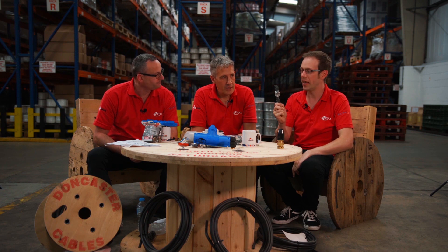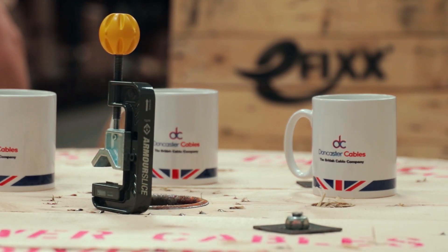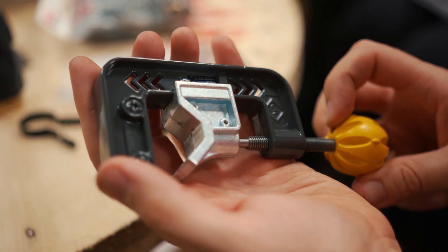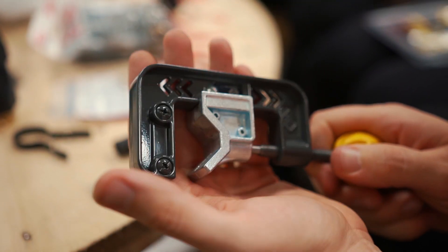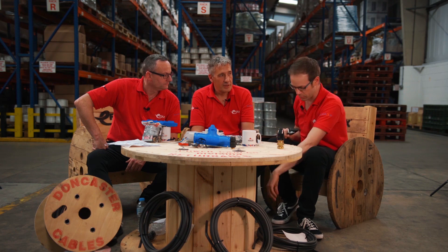Back to me — I've got the CK Armour Slice. It does look like a plumbing pipe cutter. It's designed for stripping the armouring off armoured cables. Just as if you're using a hacksaw, you're not looking to cut all the way through the armourings — that would be the first mistake. What you're aiming to do is just score those armourings so that you can snap them off. It works in exactly the same way as the pipe cutter it very much resembles.